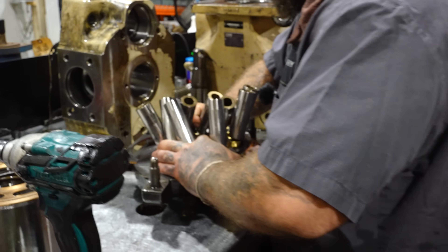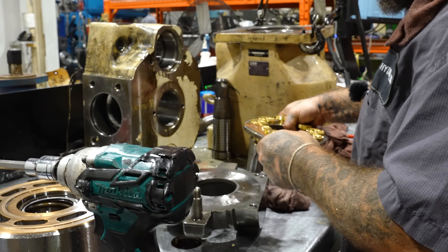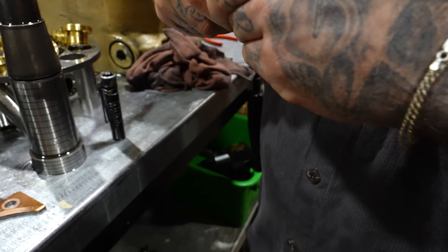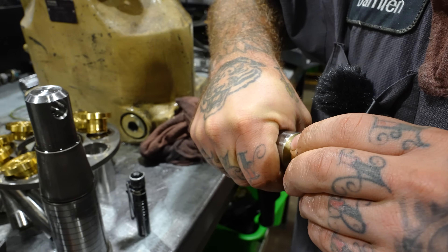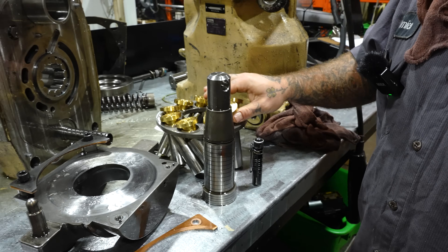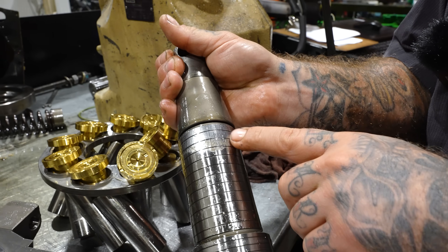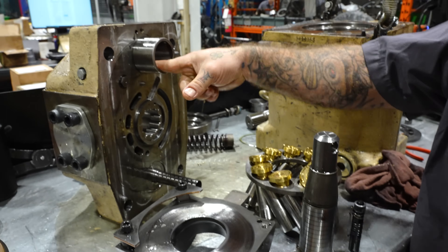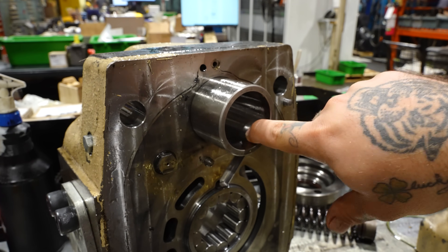You can see some damage when pumps are on comp for a long time. Pistons — too much pull-off. I don't know if you can hear it, but... oh, there is pull-off? Yeah, I do hear it. It's there. On first glance, this servo piston needs to be replaced. It's got some significant wear right there. And you can see in the housing as well the matching wear in there, so that's another part that would probably need to be replaced.